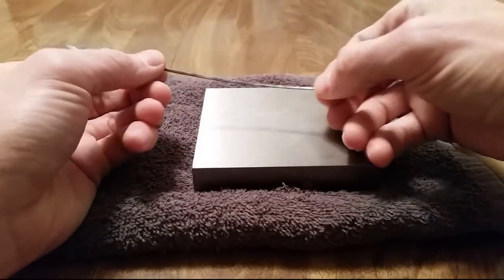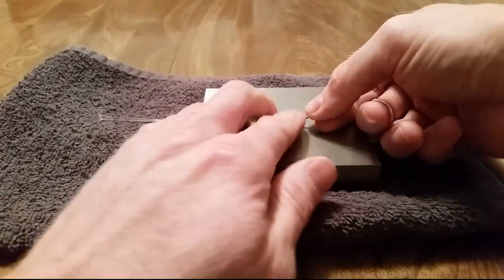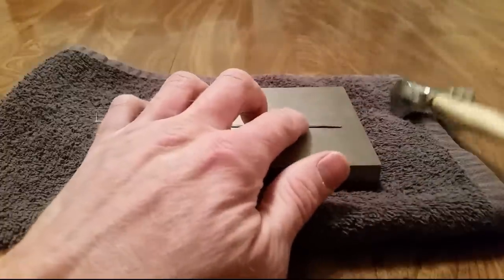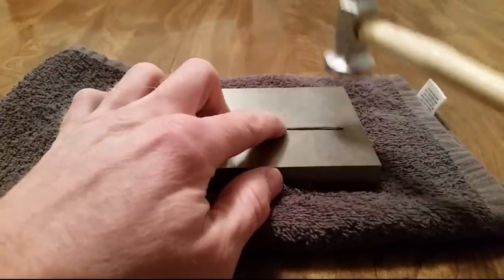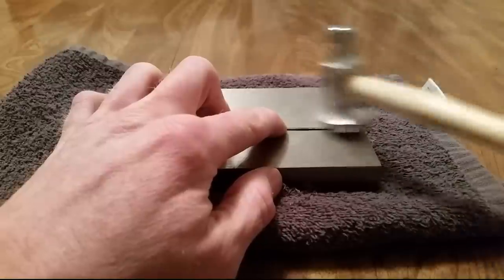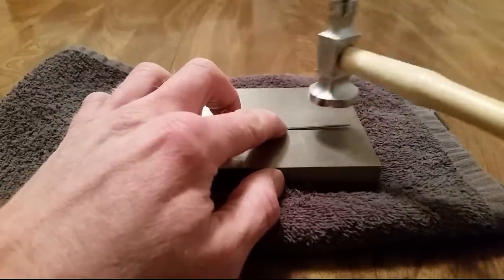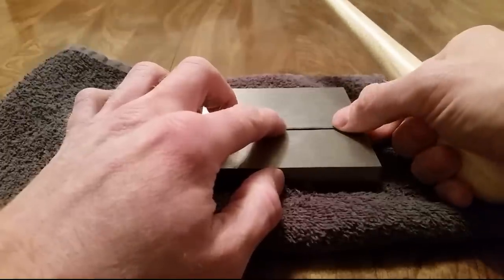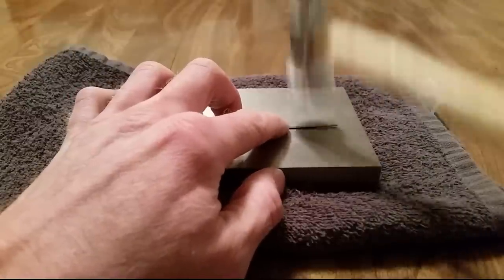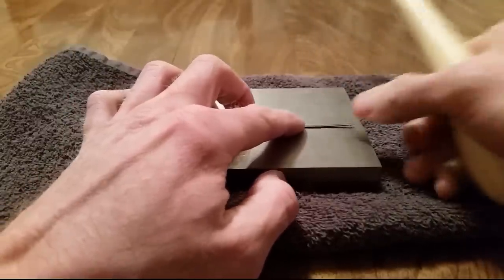So I'm going to go ahead and do that again. It's not as even as I want it to be as far as how flat the wire is and how evenly it's flattened. I'll go back over it again after I torch it, just to get those last little imperfections out. Because not just for aesthetics, it's going to look a lot nicer if it's even, but also because it's less likely to have hot spots internally in the wire. And it's just going to perform better the more even it is.